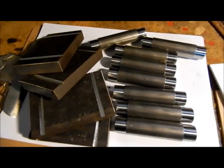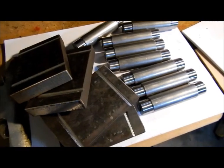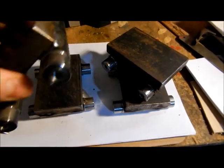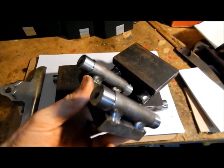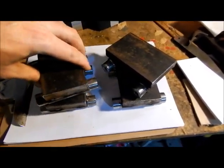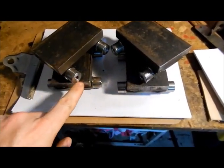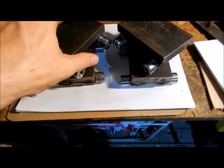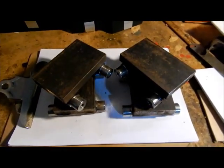All the shafts and plates are ready to get welded — I'll weld them tomorrow at work since my welder's not up and running at the moment. Here are the parts all welded up. I welded on the inside and on each outside. Now they're ready to fit up — I'll put the bearing on, put a little anti-seize on the bolt, clamp them in the vise, do them up nice and tight with the washer, and they'll be ready to go.